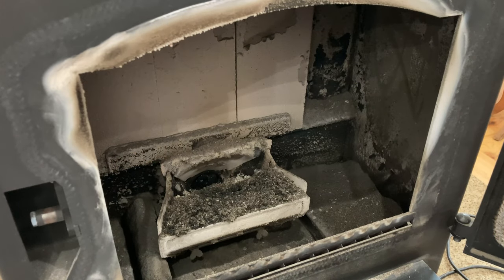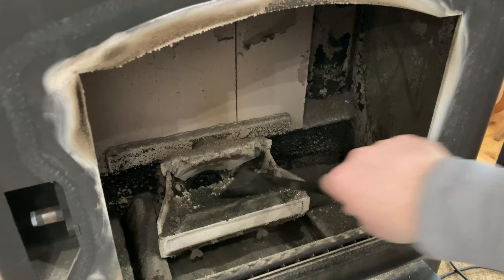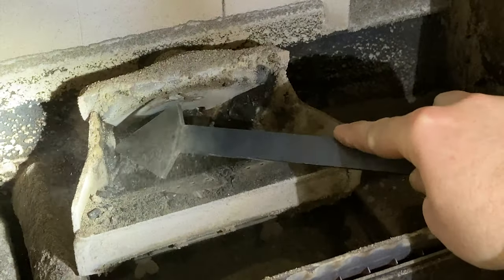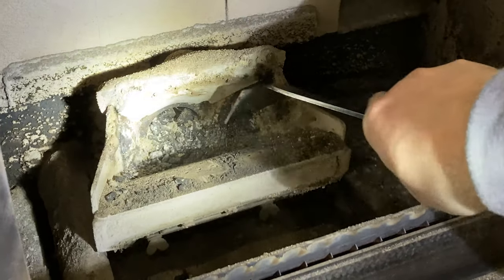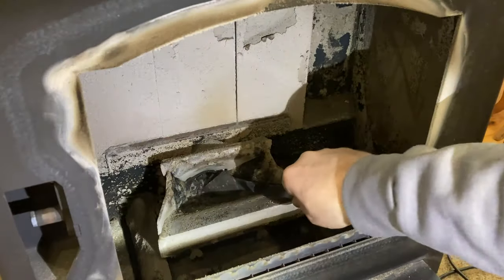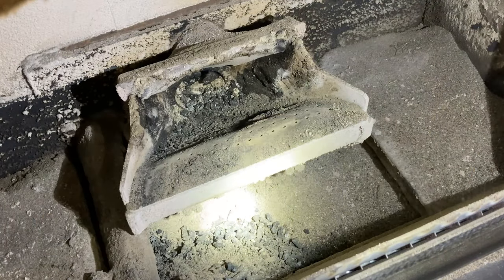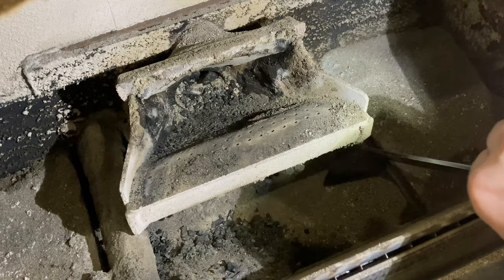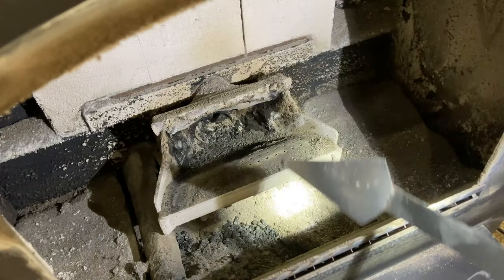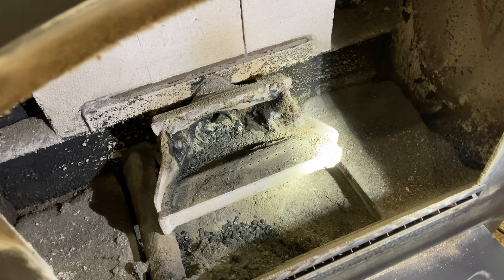If it gets to this point, you've waited too long like I have. This stuff along the edge would just get scraped out each morning when you're using the pellet stove. You can see there's a lot of build-up along this edge that should be a flat edge — there's a lot of dust everywhere inside the stove. When you look down into this ash pan it's almost up to the side levels, which is way too much. It's too much to even pull the pan out without spilling, so I'll vacuum some out before I pull the bottom pan out.